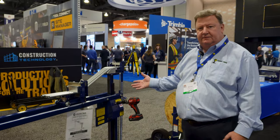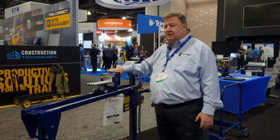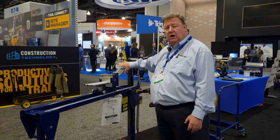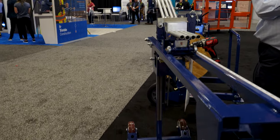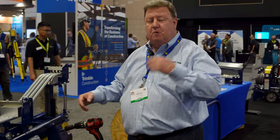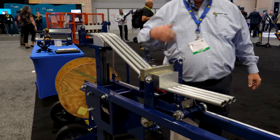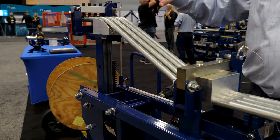Next up was a company called Current Tools. They have this machine right here that you can stick multiple sticks of conduit in and set it to bend offsets for you, so you're doing multiple at a time. I'm Bill Jones with Current Tools, based out of Greenville, South Carolina. This is the 754 offset bender - it'll bend offsets, it'll do half, three-quarter, and one inch. There's also a shoe that you can purchase that'll do four half-inch pieces all in one shot, and a shoe that'll do two three-quarters at once. It works with anybody's drill - just not an impact type drill. It's fully adjustable: this little rod here you can rise up, set your height, and make every bend with the exact same rise and height. Made in the USA, in stock and ready to go right now.